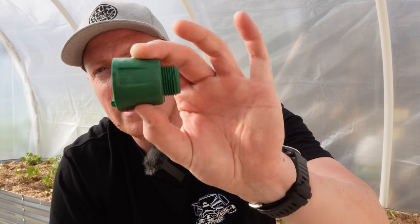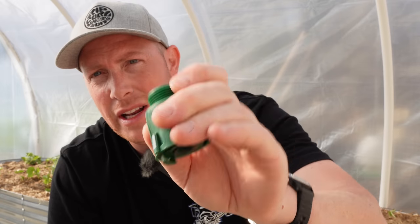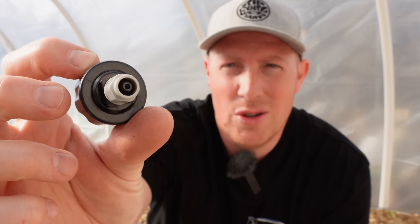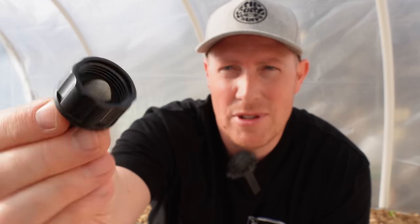The way these join up to your hose system — there are a couple of ways. This is the HoseLink-style tap connector with a three-quarter inch fitting, so it's a standard tap fitting. The kit comes with this little end joiner: one side joins to the grey hose and the other side goes to a three-quarter tap, so you could join this onto a sprinkler solenoid — which is what I'm going to do — or hook it onto your normal tap and away you go. Let's hook in; I'll show you what I'm doing with this misting system and then we'll see if it all works.